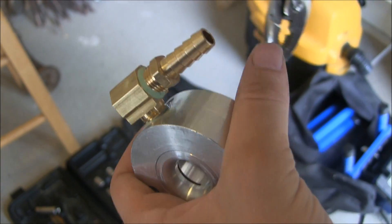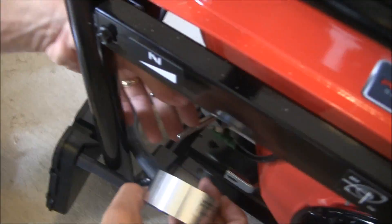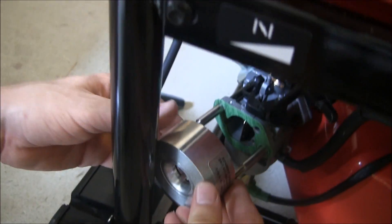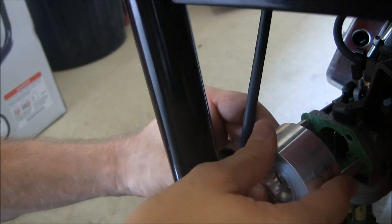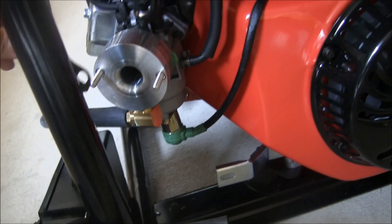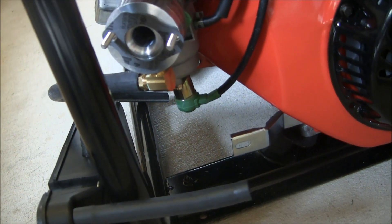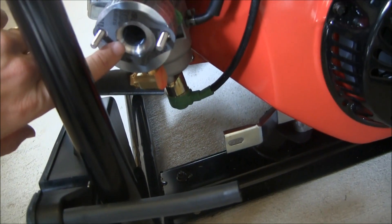We took that part out and put some sealant on it, and now we're going to put it on to the generator. We've got it done — put the hose on. It should slide in pretty well. We'll go ahead and put back on the air filter. We've got to make sure we add the gasket to avoid the vacuum leaks that they talk about. We didn't touch the one that was on there previously — this is the one that came with the kit. We've put that on and now we're going to tighten everything up.